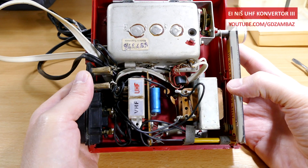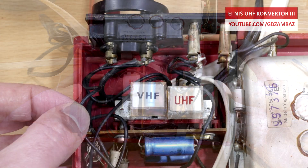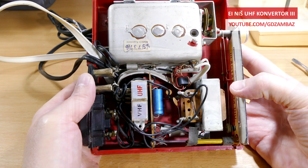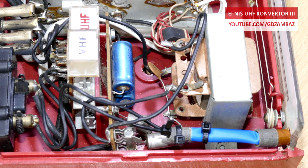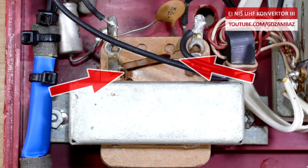What's important to note for this particular model is that the primary coil of the power supply transformer is not directly connected to the mains power, but is actually connected in series with the power socket on the back, which means it will be in series with the TV which is to be powered from this socket. For both devices to work properly without reducing the voltage for the TV, the transformer is designed for a nominal primary voltage of just a couple of volts instead of 220 volts, and has very low impedance on its primary side. On the following photo you can see that the primary coil wire diameter is bigger than it would be if this transformer were connected directly to the mains.